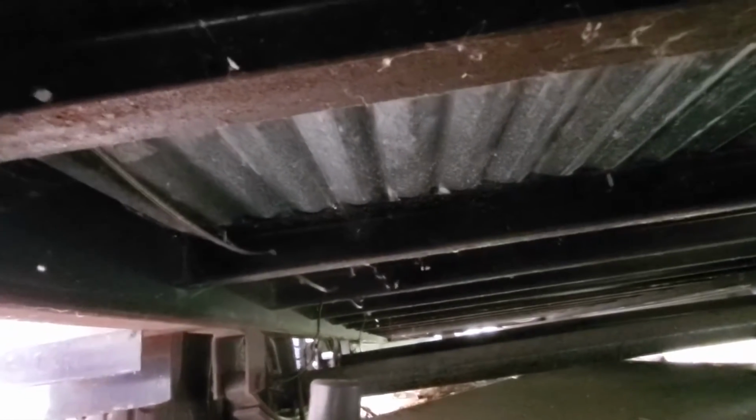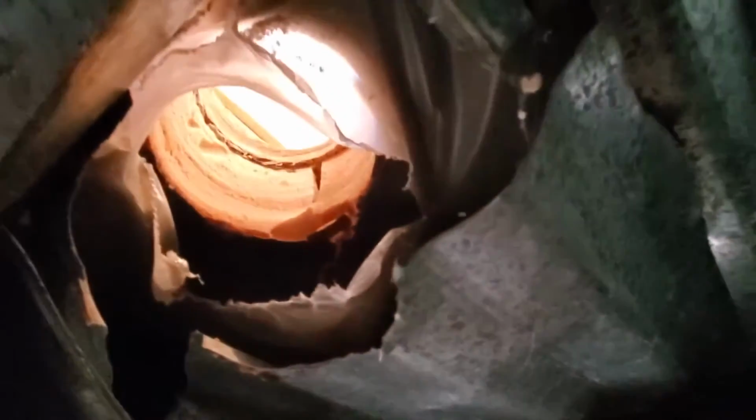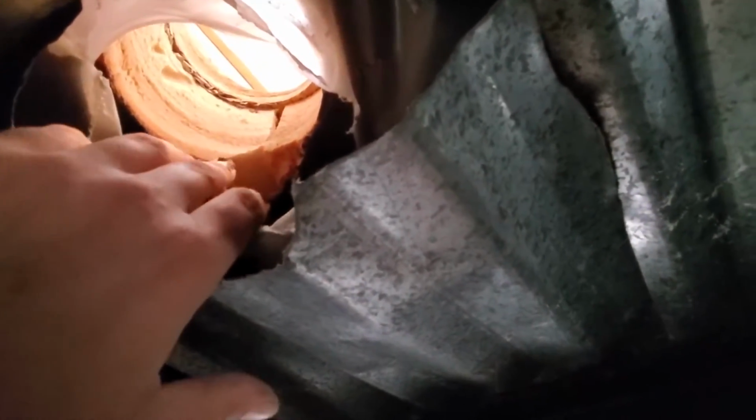I was curious about the floor construction on this tiny home, and now I'm learning exactly what that looks like. It appears we have the trailer frame, on top of that a protective layer. This looks like steel, maybe aluminum, I think steel protective layer. There's a vapor barrier plastic, followed by very thick insulation foam, and a subfloor of plywood. On the top surface is my new bamboo flooring. I imagine there's some kind of structure material in here as well, between the trailer frame and the top of the subfloor, surely. I'm impressed by the amount of insulation they use. It's quite thick.